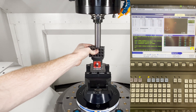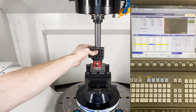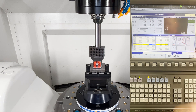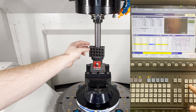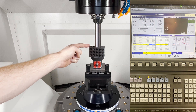As you move it down, make sure you keep moving your 1-2-3 block until it gets pinched and then move it off until you're barely feeling the bottom of that test bar. Once you have that, leave it in the machine, go to your control, and go to your work offsets. In this instance, I'm using work offset number 60. Then go to the Z-axis and press CAL, then type in the length of your test bar plus the length of your 1-2-3 block, whichever side you used. I use the 2-inch side, so therefore I'm typing in the length of my test bar plus the 2 inches.